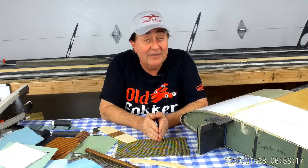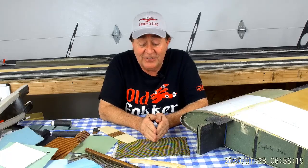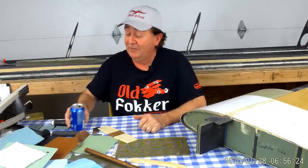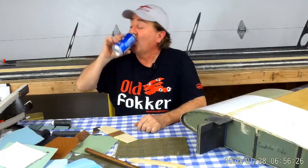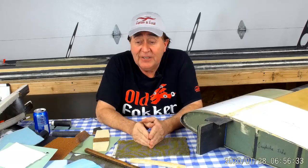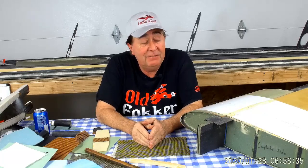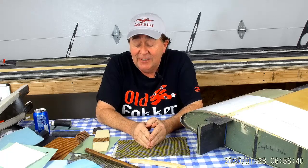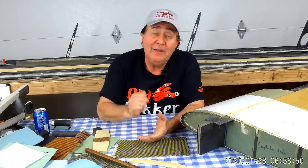You have a very complex aircraft design done in the latest composite materials with the cheapest of hand tools, and it has pushed the design in some interesting directions. One of the main considerations is that a home builder cannot make a set of female molds for molding all of these sandwich panels to build the wing components, because the molds are going to cost as much if not more than the aircraft — and he's only going to use them once. It's just not doable.